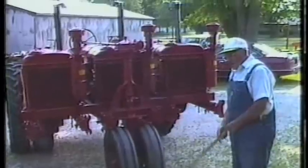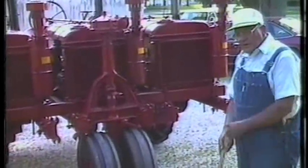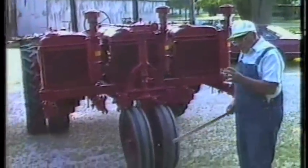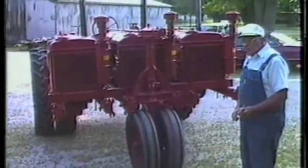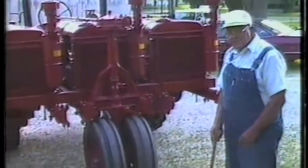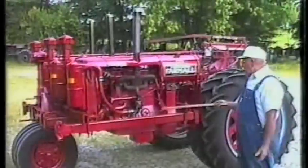The center engine does have four-inch pistons and sleeves in it. On top of that it's got a high-compression head — of all the Farmall owners I ever owned, they only had just this one head. It stayed around here in the shop for quite a while. One day I just decided I'd better use it, because it's a quarter of an inch more compression and uses a little bitty spark plugs. I found out I had something quite rare and thought this would be a good place to use it. So directly when I fire this thing up you can sure tell that center engine has got it. I think it should turn out an awful good 20 horsepower — that's all they put out in the first place.